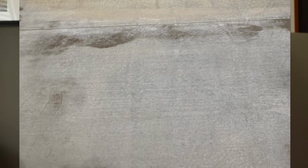Even if you walk across your concrete, and even if you don't have this residue, if it is discolored, if your concrete was poured and it has cosmetic weird stuff going on, it doesn't look normal, it's most likely a bad batch of concrete, okay? Bad batch chemistry. If you're a homeowner and you were watching the pour happen, maybe the contractor told you that the concrete was drying too quickly, or maybe something silly happened during the pour, maybe it was just an extremely hot day and that concrete wasn't able to cure correctly because it was too hot. Maybe it rained on the concrete too soon after the pour. Silly things happen, okay? All this can cause a bad cure, and this calcium or potassium or Portland residue, it could be anything. It is the kiss of death for any concrete coating you may consider.